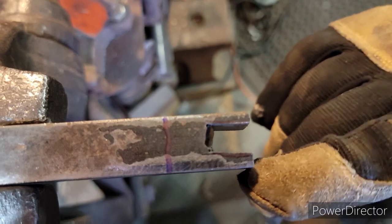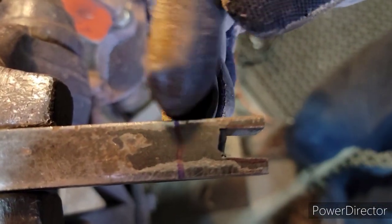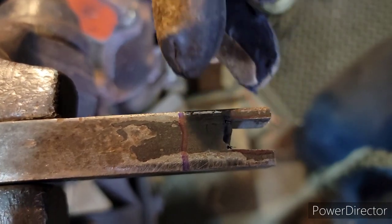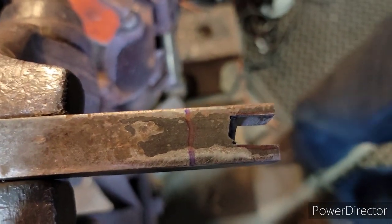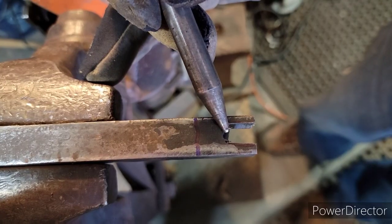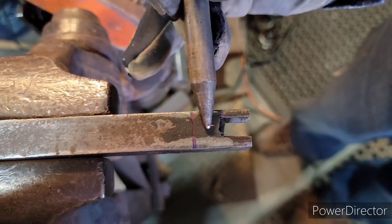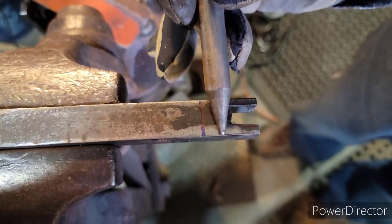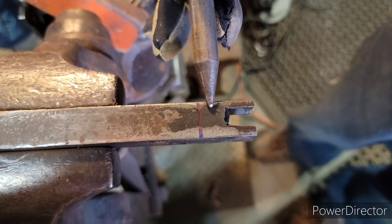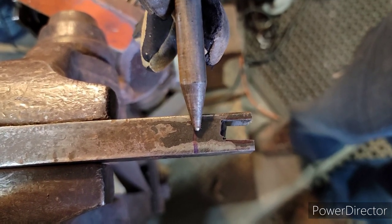So this is the start of our legs. We've got one set here, one here. Now we've got to pick the distance for the shell. You want some space from the legs here. So from here to here, there needs to be a little space. Give yourself a quarter of an inch, eighth inch at least, before you try and figure out the length for your shell. And it's just a guess.